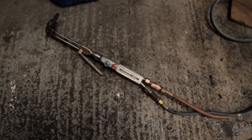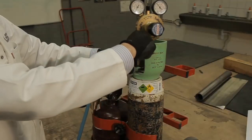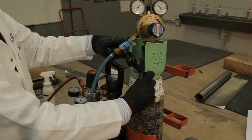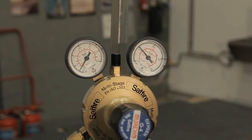When you've completed welding, turn off the torch by turning off the acetylene gas first, which will extinguish the flame straight away. But don't forget to turn off the oxygen gas. Now turn off the gas bottles, either by hand or with a valve key. It's important to check that the dials on the gauge remain the same — if they start to fall once you turn the gas off, this could indicate a faulty gauge and you should consider replacing it.